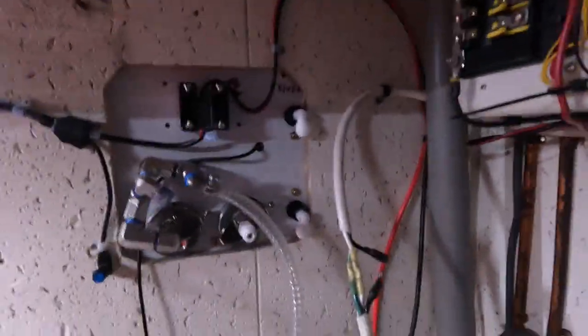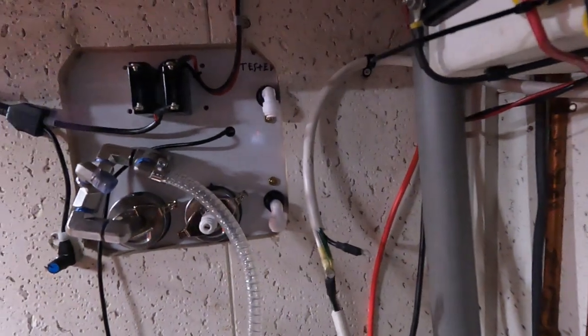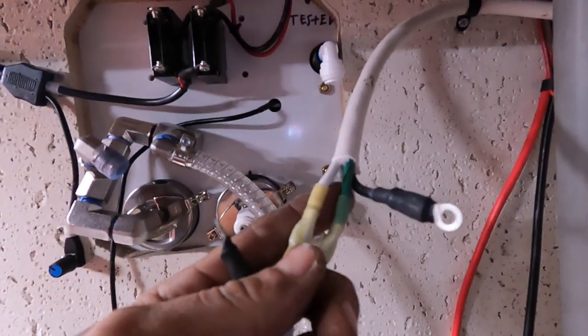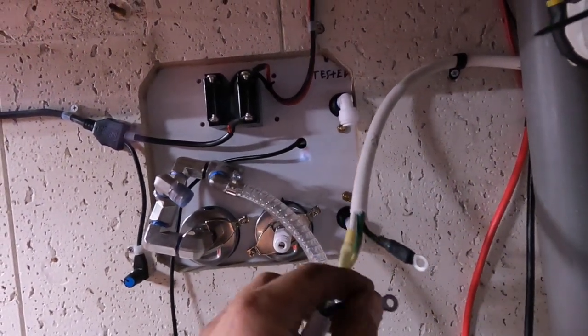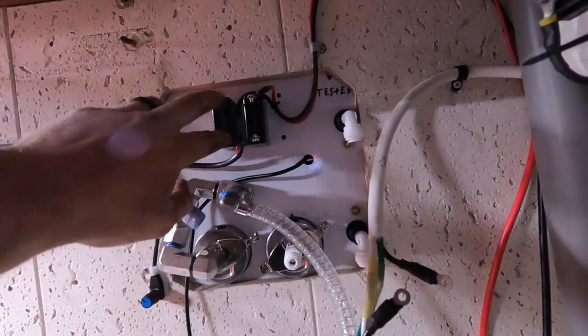And then the AC is the one I wanted to show. You can see it coming from the motor. I'm not gonna hardwire it, I'm gonna put it through a plug in here. So now you have to have the switch sized and interrupted. With AC you've got your neutral, the white, then your ground, the green, and black is power. With AC, because it goes back and forth, you have three wires, right? But black is your hot, so black's the one we're gonna break and put on the switch here.